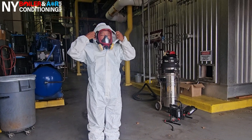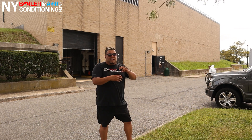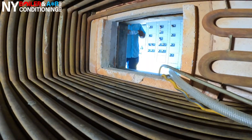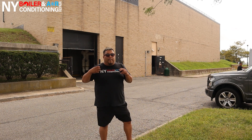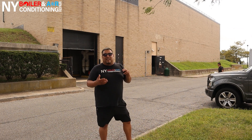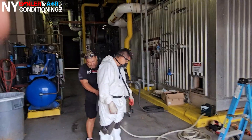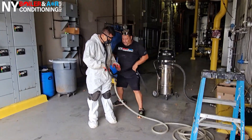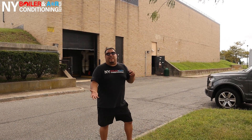Part of working on a commercial application is safety. We want to make sure there's fresh air inside the boiler — sometimes you have to pump fresh air into the boiler. This particular boiler has only one way to get in and one way to get out. We want to make sure number one it doesn't get too hot in there, so we have water on the side ready. Also we have facial masks because we don't want anybody breathing in all those particles, especially soot — you don't want to damage your lungs. PPE is the number one thing. Make sure you wear the suits or proper attire. We got the suits, we got the mask — we do have a mask that pumps oxygen into the actual mask because sometimes it gets very hot in there. Some people like the oxygen-fed mask, others prefer a regular respirator. Either way, protect your guys and protect yourself.